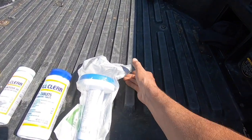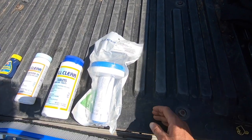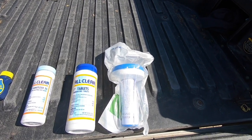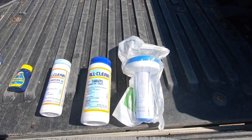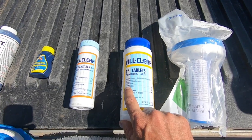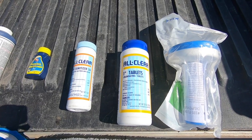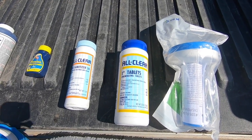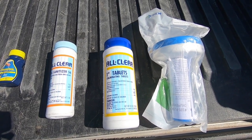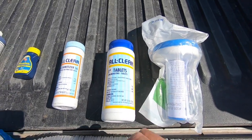Here's what we're dealing with. I got us a 1-inch floating tab dispenser, because we really don't need 3-inch tablets for a pool this small. We have our 3-inch tablet floater choked down so much that it would just be kind of ridiculous. So we got a little bit of adjustment here between our 1-inch tabs of trichlor. Trichlor tabs, as you know from our chlorine videos, lower pH, chlorinate, and add about 6 parts per million of stabilizer for every 10 parts per million of chlorine we add to the water.